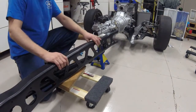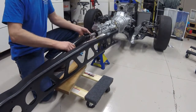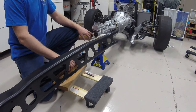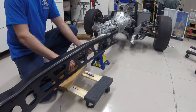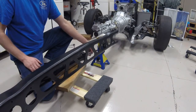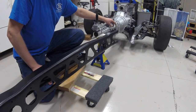I'm going to put the two halves of the car back together. Basically this is two pieces — I have my driveline here and this yoke needs to slip into my output shaft for my transmission. I very lightly oiled this transmission seal here to help with the driveline going in. Now there are splines on the output shaft as well as on the inside of the yoke of the driveline.